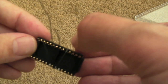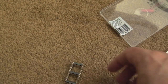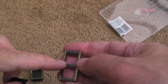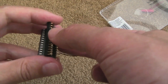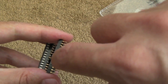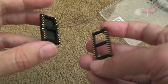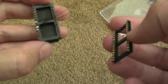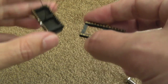So here's a quick update part way. As you can see, I've trimmed off some of the pins on the socket that goes to the EEPROM in correspondence with this diagram. What I'm going to do now is cut a really thin sliver of insulation tape and mask off the particular pins that don't want to marry up. Then I'll slide this over the wires so the wires are through the middle here and I'll just solder onto the extended part of these legs, not the top thin bit, but the very top parts there. That way you can minimize the length and get it all just right.